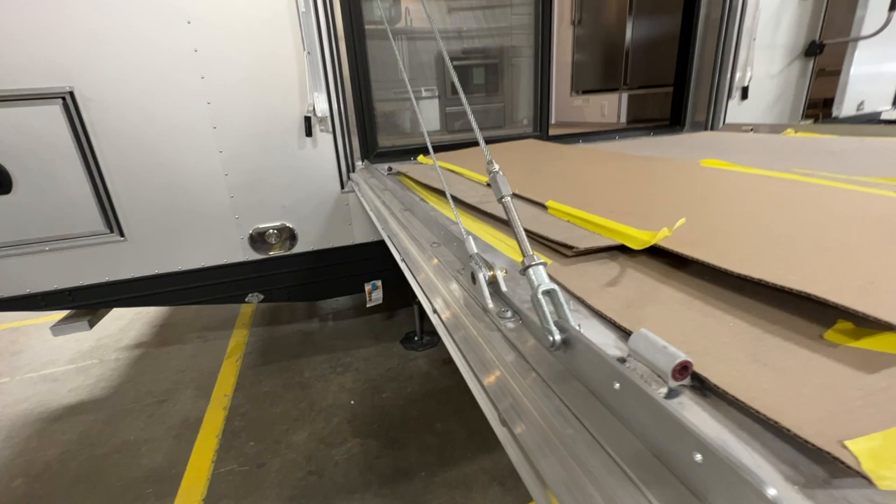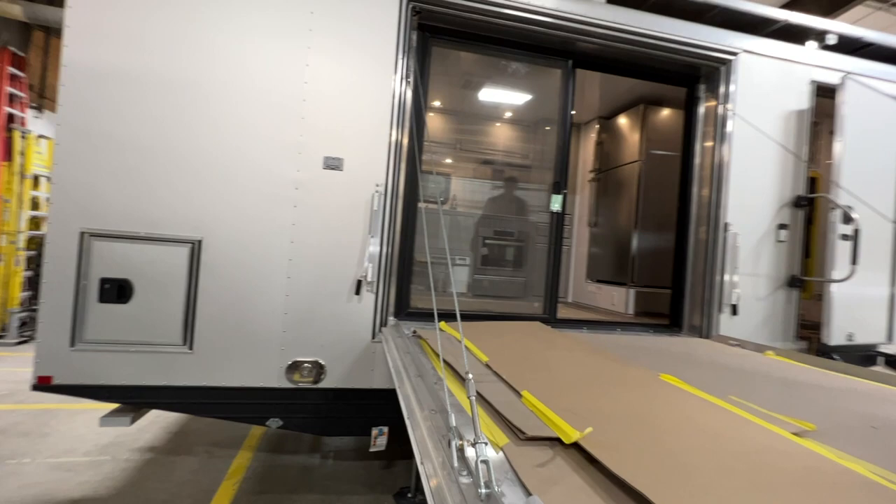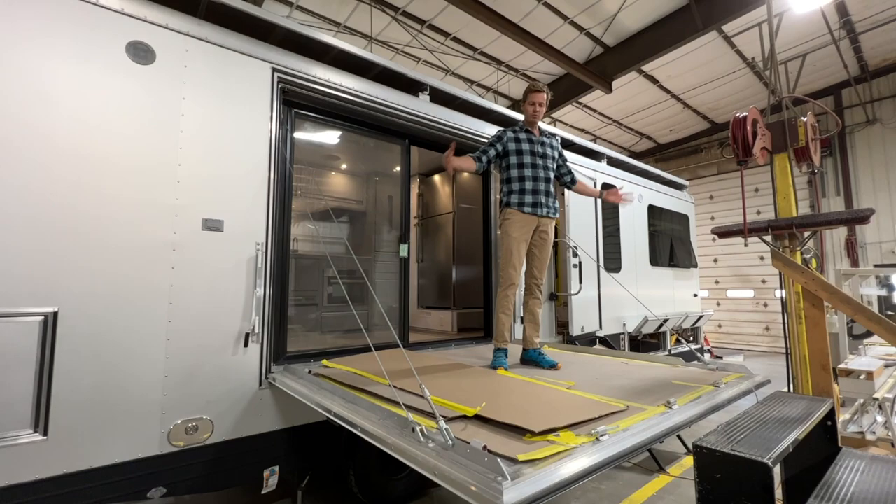The deck itself is completely self-supporting — there is no support underneath. All cables and hardware are integrated into the deck to completely self-support the system. The winch cable supports pulling the deck up and down, and there is a support cable as well. Marine-grade stainless steel hardware throughout, designed to last a very long time. Inside production this deck is rated at 1,500 pounds. It has a collapsible railing that stores up against the deck surface, so when you raise it you don't have to remove it.